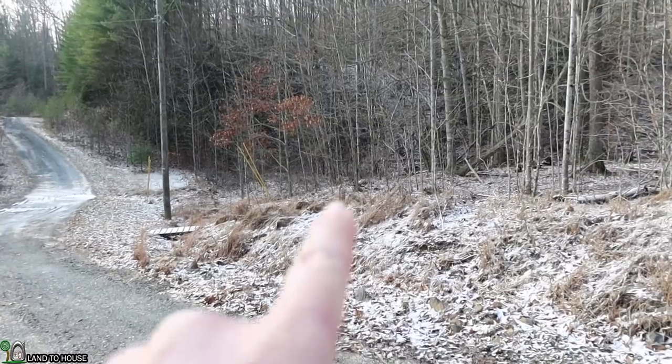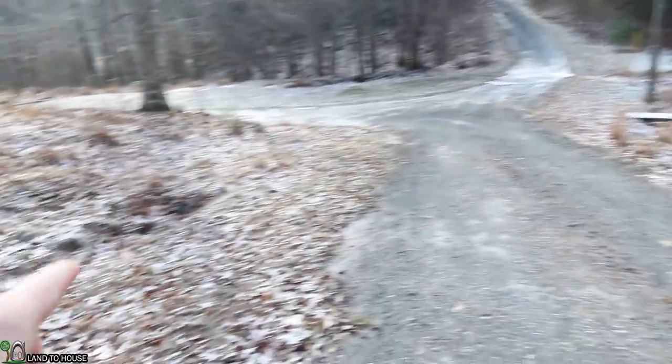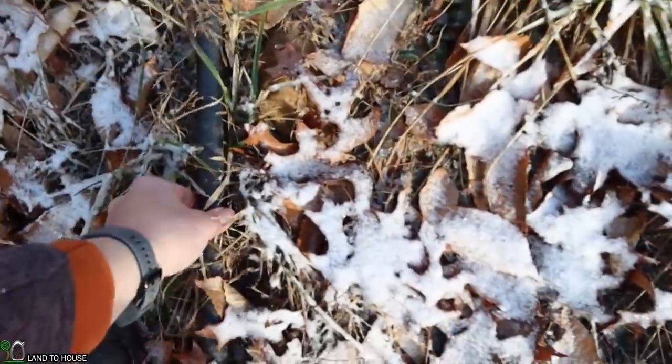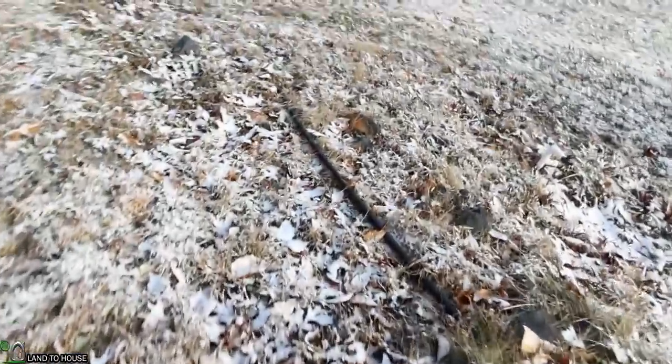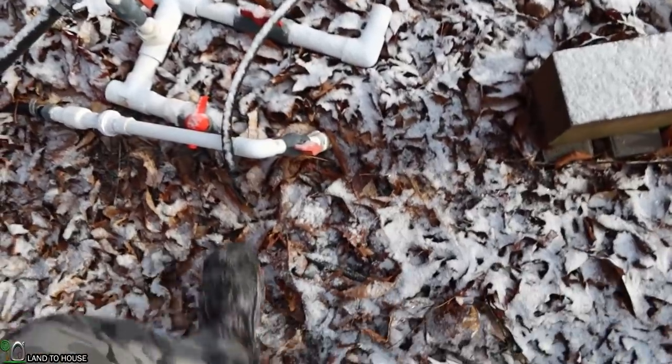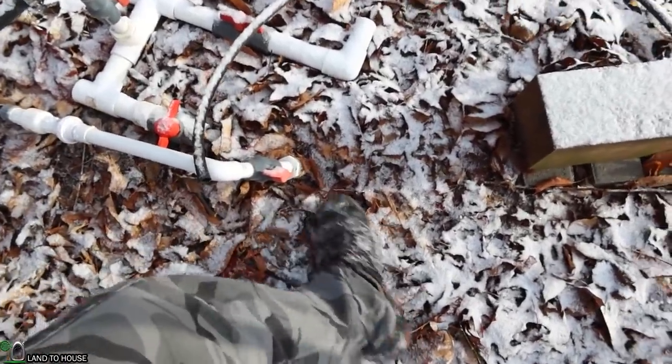I intended on pulling the delivery pipe up into a tree so we could watch the ice form, but I did not do that — it's too cold. The ram pump starts right here. The pipe goes under this little bridge under the road through a culvert right here, and it's semi-buried under this little trench and then exposed here. It's empty — I'm not feeling any water in that. So what may have happened is it was still frozen from yesterday and I never did go up here to see if there was output. We may have just never even pumped anything up the hill. May have to do this test again whenever it thaws out. I'm building a new water tower so I have all of this in a mess right now, but I don't see any output that happened here.